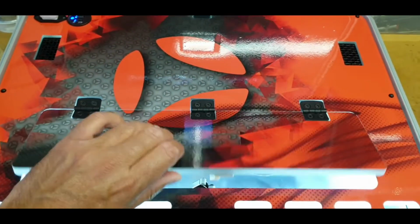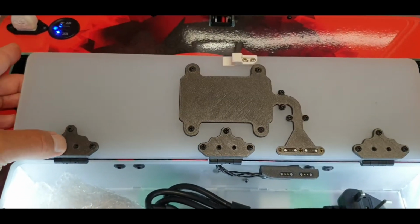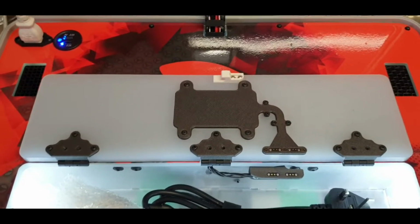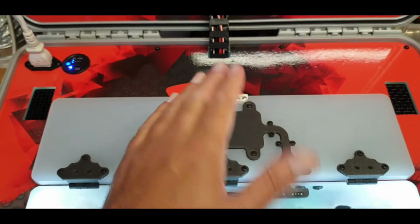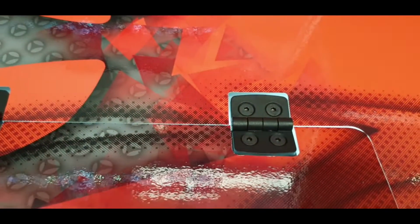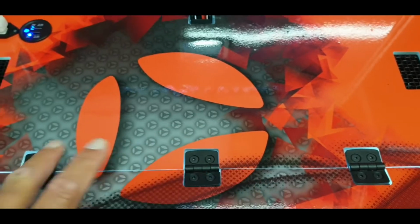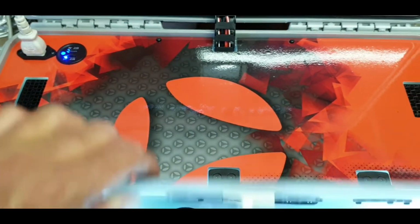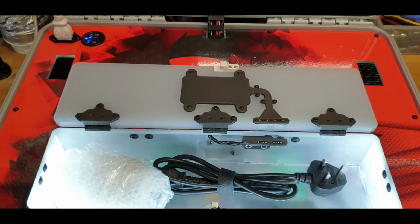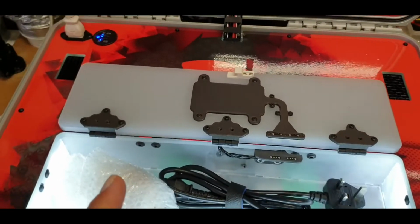So if I pop it, I can open it up, and you can see how I've done it. So we've got 3D printed parts. I've moved to not double handing the decks now, because most of the machining is done from the back face, and then for the recesses, for example for these hinges, I would have to flip the deck over and machine these cutouts from this top face. So I'm mounting the deck twice on the CNC, which adds cost, adds time, and adds the potential for errors to creep in, which isn't what I want as a machinist.